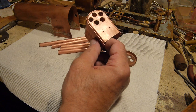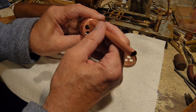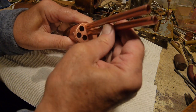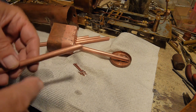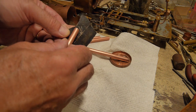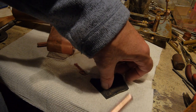These are the fire tubes, made out of copper tubing used for refrigerators — you can buy it at a plumbing store. I'm going to press these in. They've all been cut to length. It's not a tight fit but it's got to be a decent fit. I've got a black marker mark on one that the acid doesn't seem to get rid of easily, so I'm going to rub it off with a little bit of emery paper. It might affect the silver soldering, as silver soldering likes a pretty clean joint, so it'll go into the acid again.